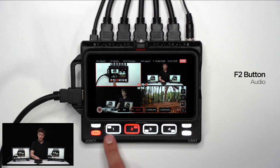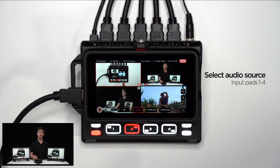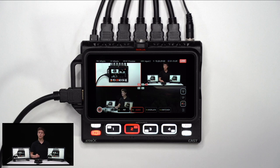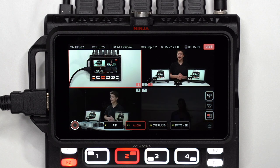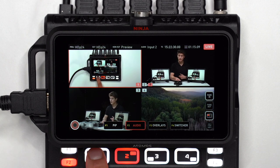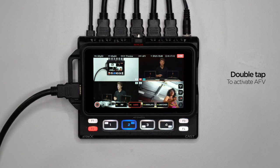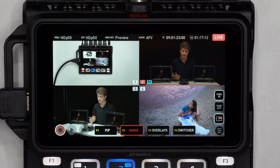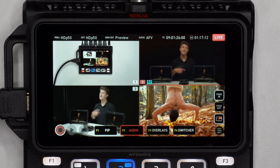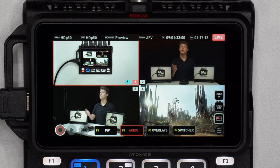The F2 button is the audio button. The 1 to 4 pad buttons in this mode act as an audio switcher — once F2 is selected, use the input pads to switch between audio from the 4 HDMI inputs. No input button will be illuminated if you have the analog mic line input selected; a mic icon indicates the input audio source. Double tapping an input activates audio follow video, signified by the button being backlit blue — in this mode, as you switch your video tracks, the audio will come from whichever video track you've selected, with a blue microphone icon indicating the source.